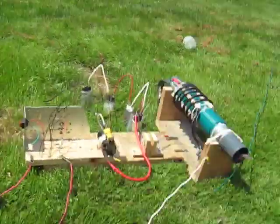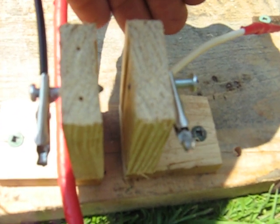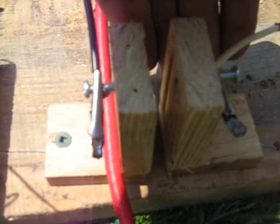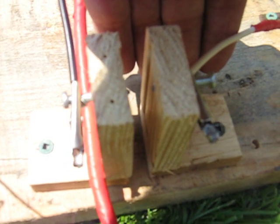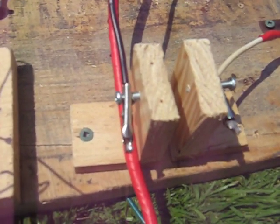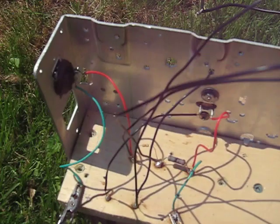Kind of disappointing. I'll flick her on. I made a little spark gap — hard to see — couple screws. It's at a good distance right now. I tried closer to start with, started at about one millimeter, higher frequency, and nothing. Pretty much nothing here. Nothing astounding anyways. It'll light that fluorescent, but this flyback will light that no problem anyways, off that 12 volt. I'll switch her on.